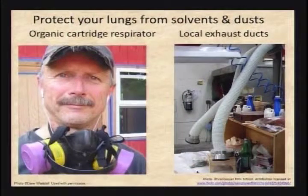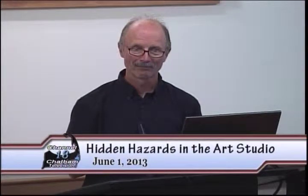She could also wear a respirator to protect herself from those vapors. This is my respirator — you can see there's a blue cartridge with a yellow cartridge behind it, it's got a rubber gasket and two nice straps that cinch up really well. The purple thing is a HEPA filter — a high efficiency particulate filter. It'll have the number N95 or N100 on it. Anytime you're buying any kind of dust mask or respirator, look for 95 or 100 — that means it'll filter out 95 to 100% of all particles coming at you. If you don't see that number, don't buy it.